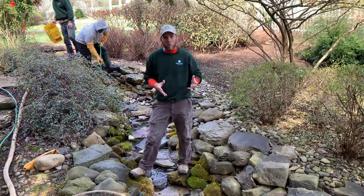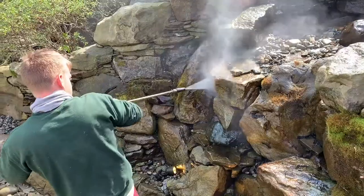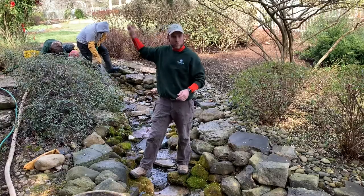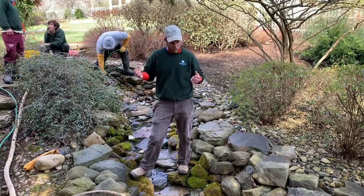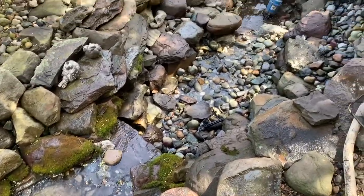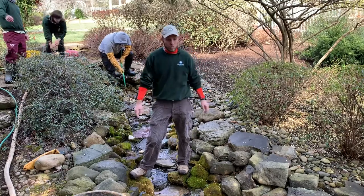This pond has been power washed out. The reason we do that is to get all the algae and muck buildup off the rocks. Now we're ready for the final stage of flushing. We start at the top, just like we do in power washing, and we flush it all down. This is getting that last bit of muck and junk — maybe stuff that's too small to pick up physically. We're getting it all down to the pump so it can either be pumped out, or at the end we have a glob of it that we can just remove.